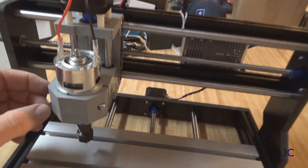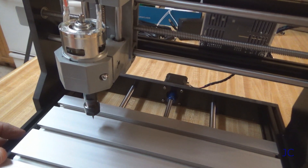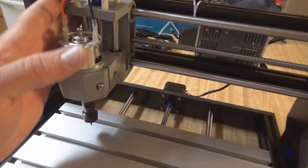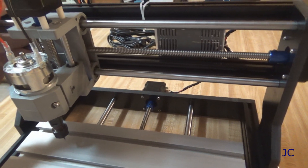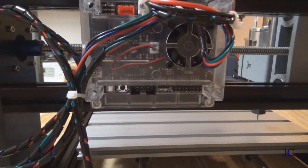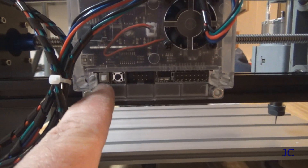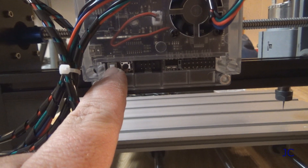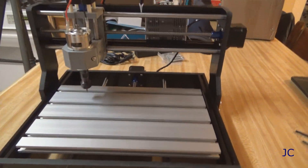It's taken me about two hours to put this together. I had some interruptions and had to go back and redo some stuff I messed up. The majority of this is made out of what appears to be 3D printed composites for the carrier of the spindle. The rest is aluminum or steel — we've got steel tubes that ride across here. The stepper motors seem to be pretty well built, and the control board is pretty easy to put together. It's coated, the motor positions are labeled, and it's got the input for the laser right up on top. I have a gripe about the power-on switch — it's a little cheesy. But shafts, collets, and everything fit together pretty well. Overall, I'm pretty impressed by this little thing.